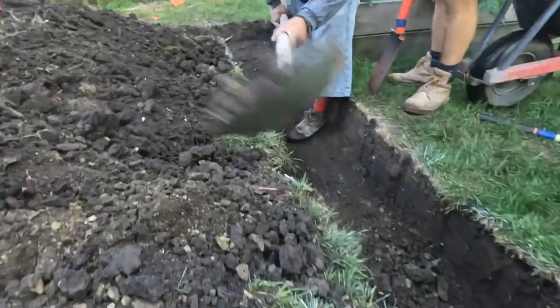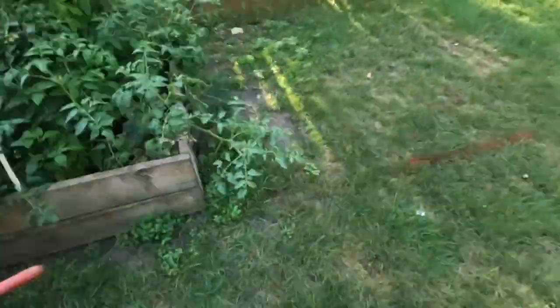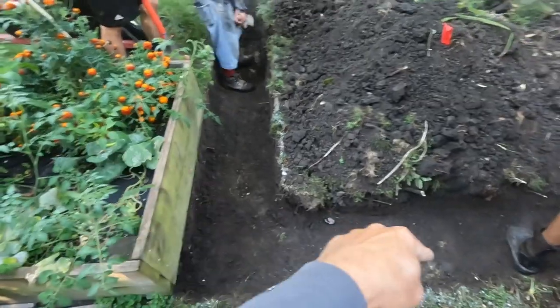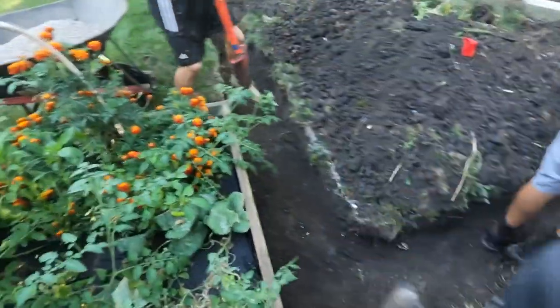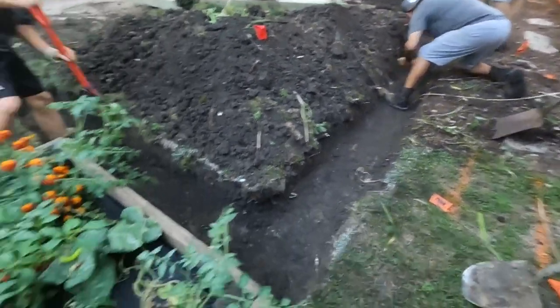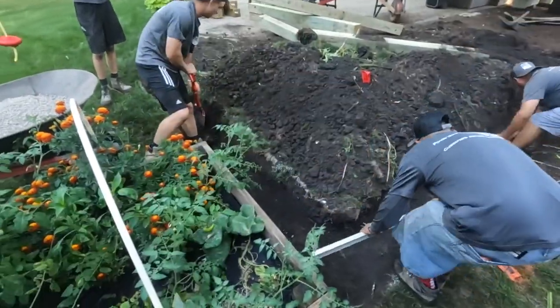You can see Juan finishing off the final grade — we're about 10 to 11 inches down there, that's our low point. We want the bottom course to be buried. We are going to work some dead men going back into the hillside or berm just to help lock everything together, but we want to make sure we get these elevations right. Then we're going to use some limestone chips to level off our base, get our timbers nice and level. It's basically an L-shape — we're going to run about a three and a half foot offset from the fence to still allow for traffic to come through, and we'll butt that timber wall right up to the back of this veggie garden.